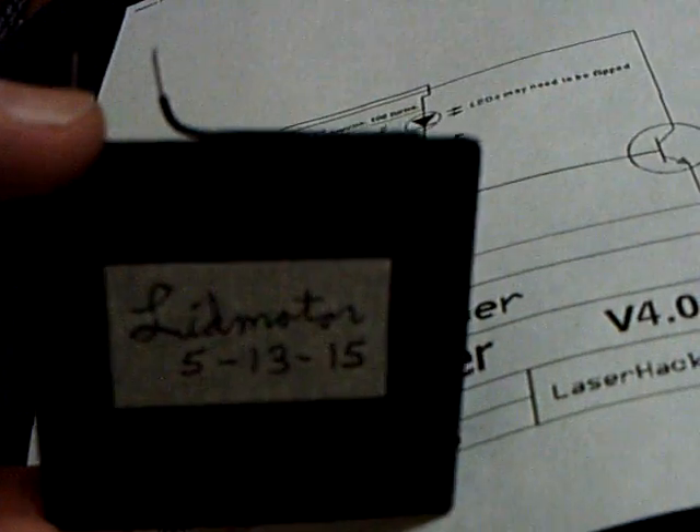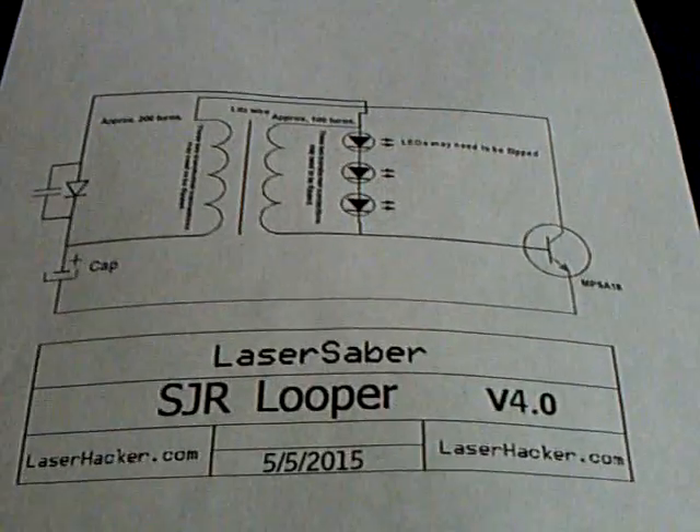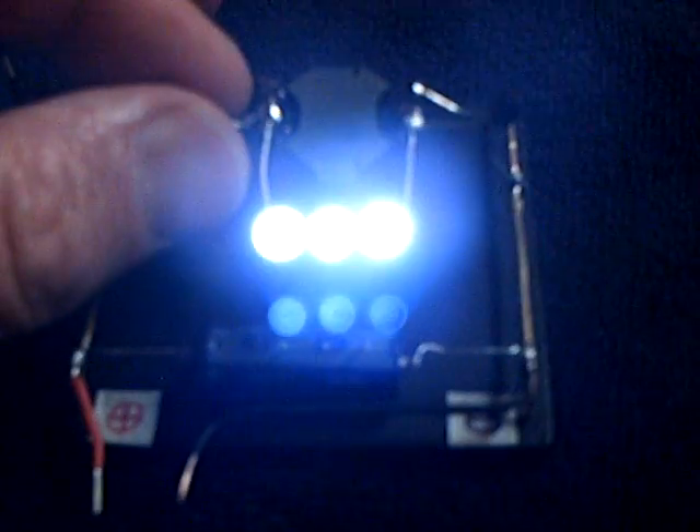I'm calling this the Looper riding the rails, and I'm Lidmotor. This is May 13, 2015, and the circuit is by LaserSaber. This is one I highly recommend that folks interested in electronics build up one of these little oscillators — that is a lot of fun. It doesn't take a lot of time, and the transformer is very forgiving. Some of the guys are doing it very differently than I am and it still works. Just follow the basic diagram. I'm using a 2-to-1 ratio on the windings, which the other guys are too, but it's not critical. It's a very forgiving little circuit and a lot of fun to play with. Thanks for watching.